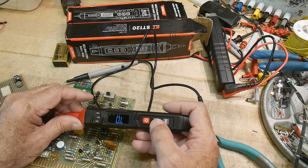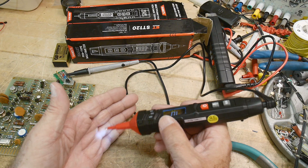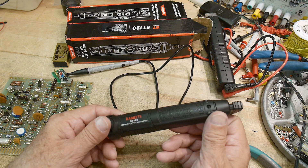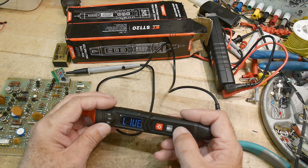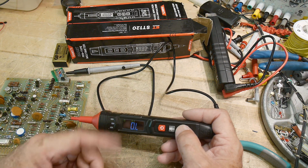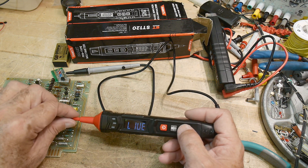There's a hold function and there's a little LED in the front — if you turn this on you have an LED and you can illuminate your work if you're working somewhere dark. To run through the functions again: auto, DC volts, AC volts, meg-ohm, ohms with a beeper, diode tester, hertz/frequency tester, capacitance testing, and AC line voltage testing.